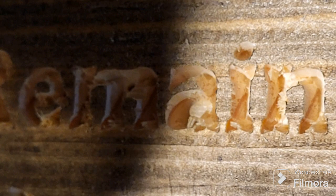Also, from the pictures you'll see here, the really pointy sharp-pointed V-bit — it's a 30-degree bit — is not really suitable for V-carve. I need more like a 90 or 120-degree bit. That'll give us a better finish. It really cut out those centers of the letters, like the letter A and M, and lost the centers of the O's and stuff like that. So it's a good learning experience.